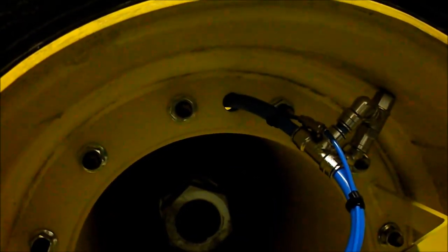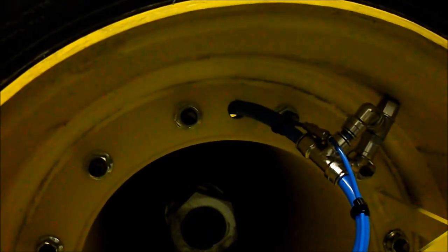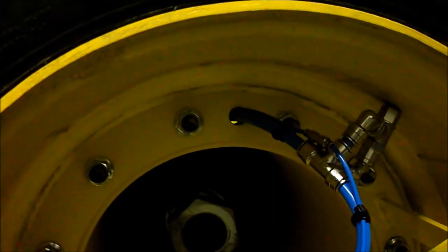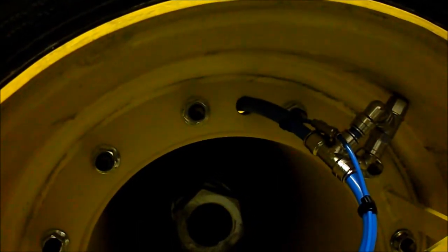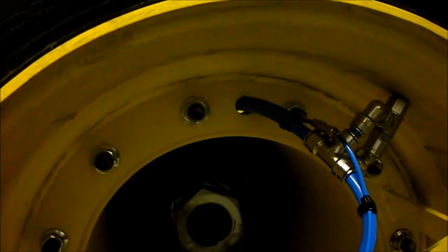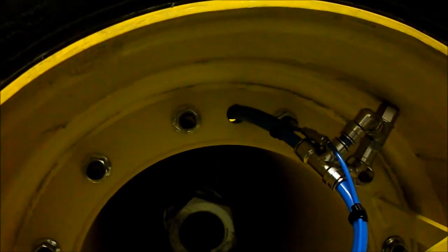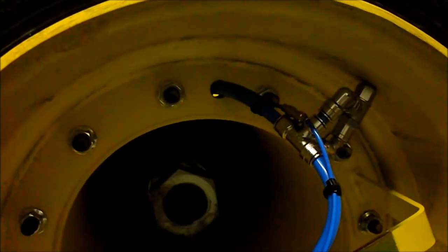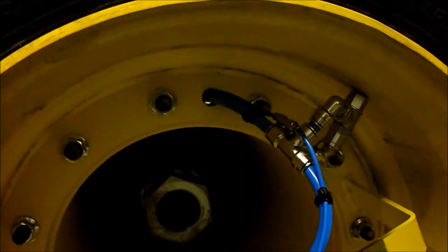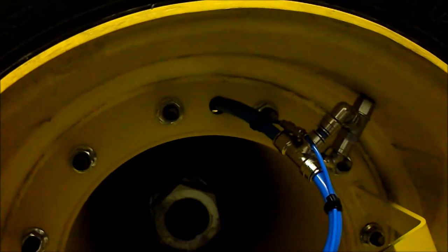It's very helpful when you get up to the larger sizes to drill through to use some bits called a hole hog. They're available from McMaster-Carr and some other companies that can go directly from 1/2 inch diameter to 3/4 diameter. They have 4 flutes on them, and they don't grab as bad and draw quite as much blood. When you're all done with your holes, you want to chamfer your edges with a slightly larger bit to get rid of the sharp edges. Touch them up with some yellow paint so they don't rust.